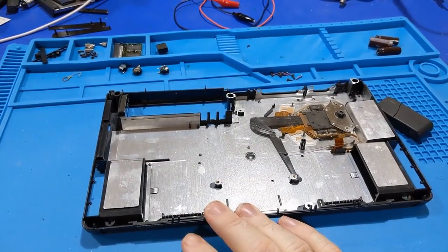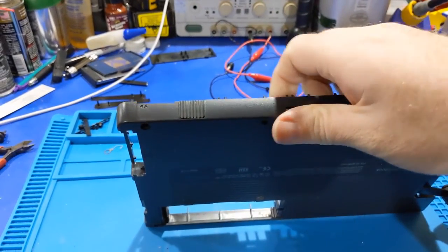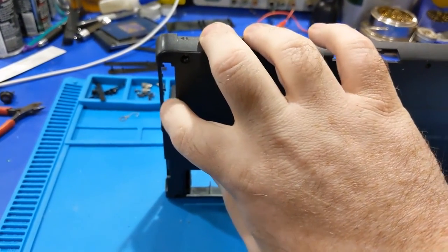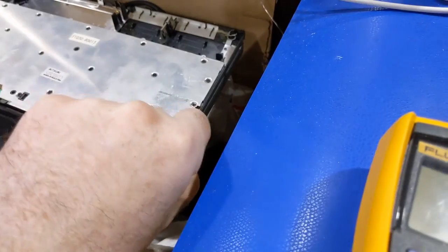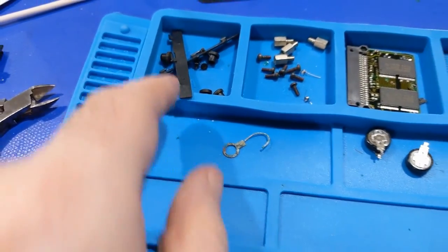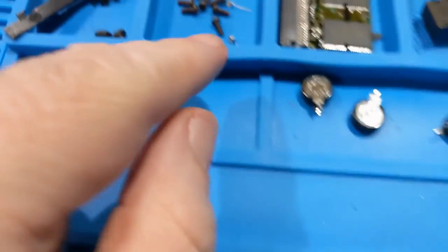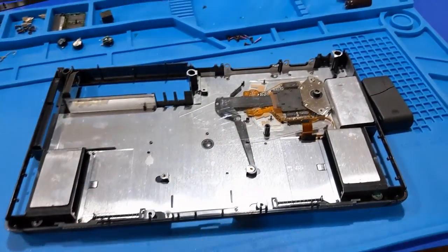It's hung up in the front. On the back side where the PCMCIA cards go, you have to get one tool in here to pry up on the case a little bit, and you've got to get a flat blade screwdriver between this plastic piece and the keyboard assembly here. You've got to pry that outward while you're prying this one upward, and then it will pop out of the groove and you'll get it apart. The little PCMCIA door flappers and springs will pop out on you - watch those springs so they don't come flying across the room. Then I got the motherboard out, and that brings me to the second part of this video.